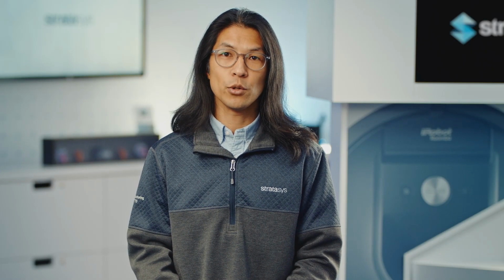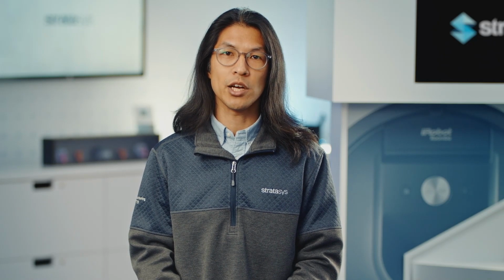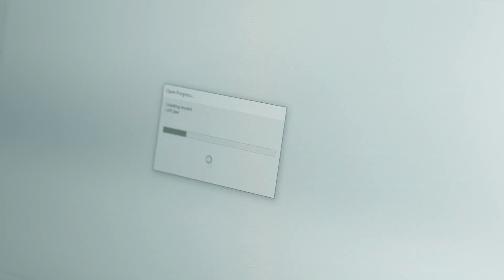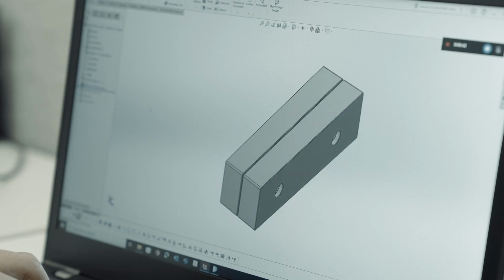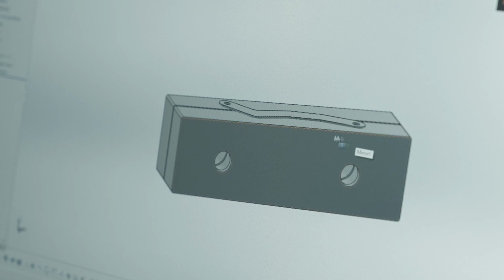Design in CAD or download a CAD model of the required jaw geometry. You need to make sure that this jaw fits your machine vise. In the CAD program of your choice, import your soft jaw geometry, as well as the part that will be machined. Orient the jaws with a small clearance between the parallel faces as they will be mounted. Orient the part to be machined so that it is inset and interferes with the jaws and the surface to be machined is accessible.